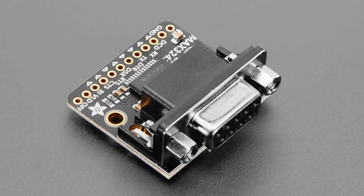There's also a pin valid, which will go high when it detects that it's connected to something that's creating a valid voltage, because again, the voltages have to be plus or minus 6 volts. And so the valid pin will go high when the peripheral you're connecting to is valid. And the off pin will tri-state all of the outputs when pulled high.